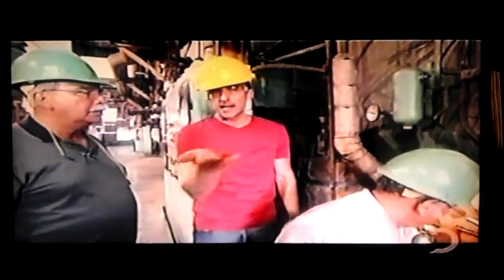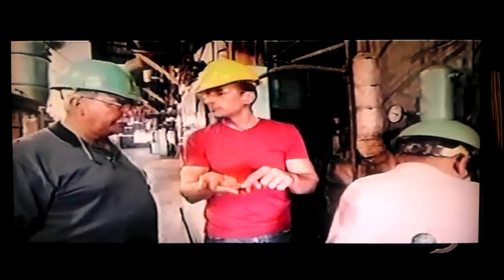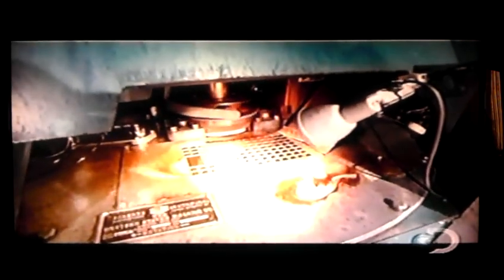But anyone can see this stuff isn't even close to pure white. Once we've judged whether we have adequate crystals, we've got to take this stuff and put it through the spin cycle — separate the molasses from the sucrose. The sugar crystals are suspended in the molasses, and separating those two is the next challenge. These crystals, now 99% pure, are called raw sugar, but white sugar has to be 99.95% pure.